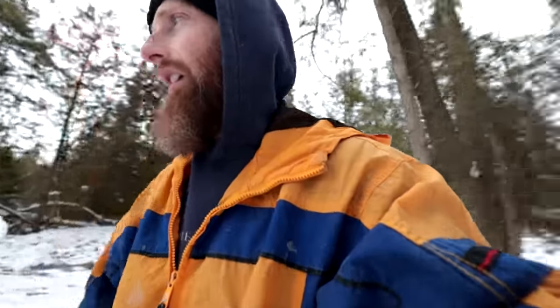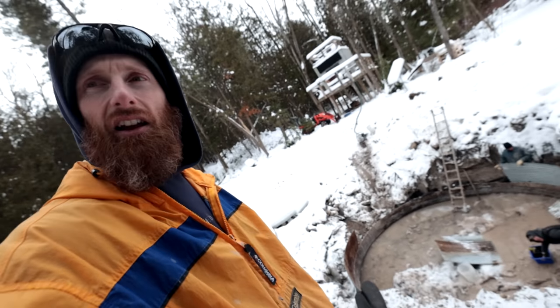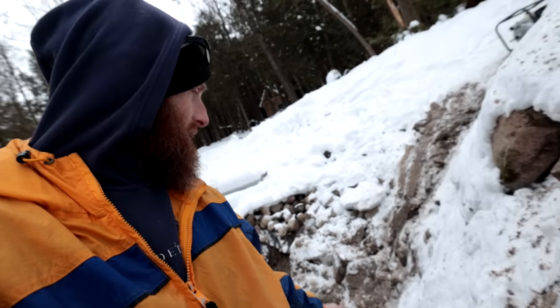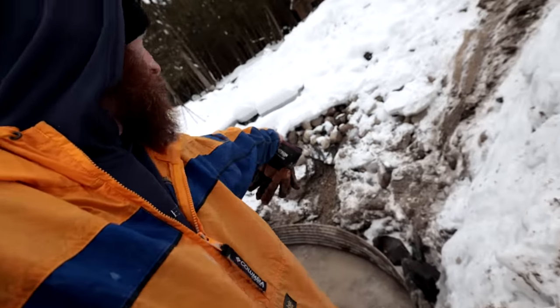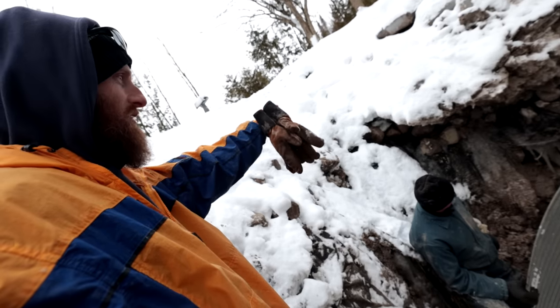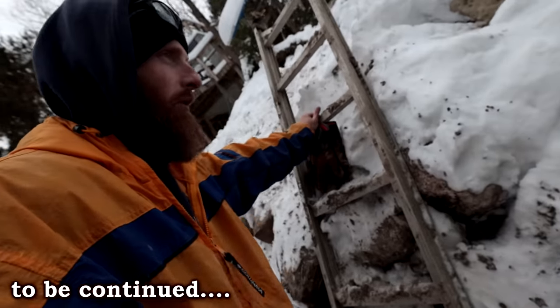Then we can regrade this whole area and have a nice place to hang out in the summer. We're going to have to figure out how many fish we can put in there. To give you guys a perspective of just how deep that is — it's pretty freaking amazing. We've got to tie the grade back into the gradient all the way around, then put some geo. There's a section here that doesn't have geo — we can see it curled back up — and that side over there doesn't have it either. We want to put geo down there and figure out a way to backfill it, otherwise everything is going to slough off and end up down below or drive into the grain bin once temperatures heat up.